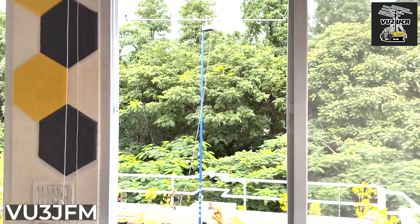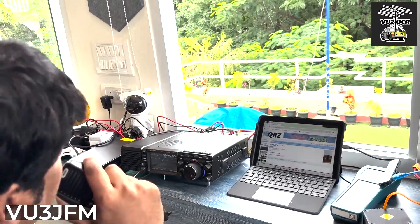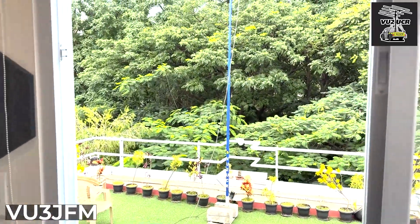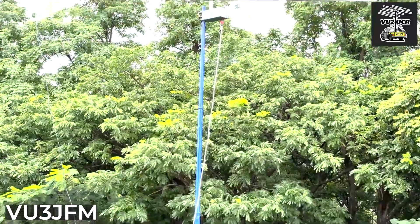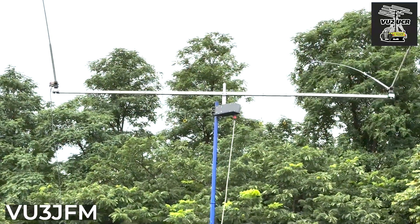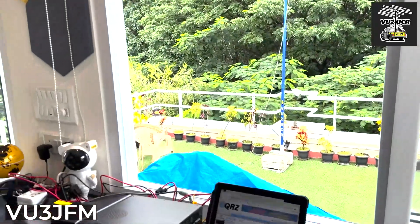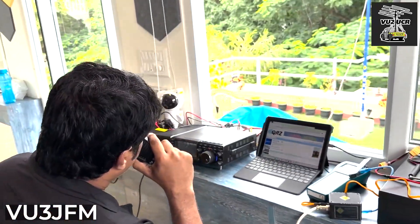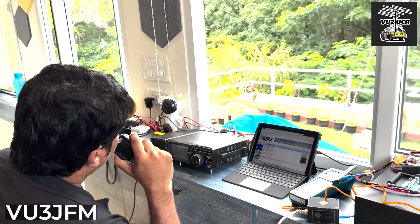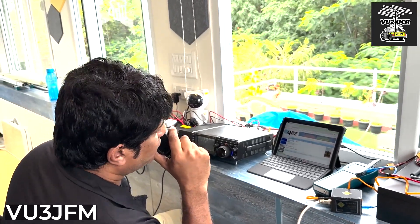I'm using a portable mast at a height of about eighteen feet and a nine to ten foot long boom with four collapsible whips, which are tuned right now to ten meters. With this building right next to it, on my home balcony I'm able to achieve an SWR of 1 to 1.5, which I'm sure will really improve when I take it outdoors. There's a DC motor on test, prototype made by VU2JXM and VU3JYU.